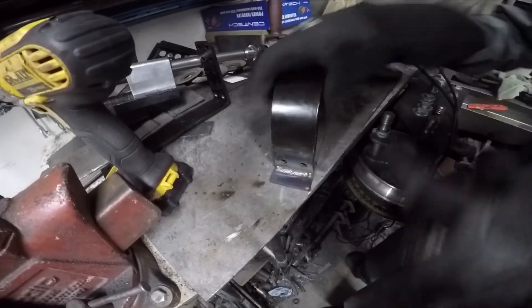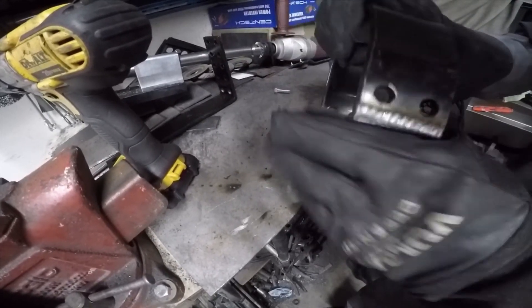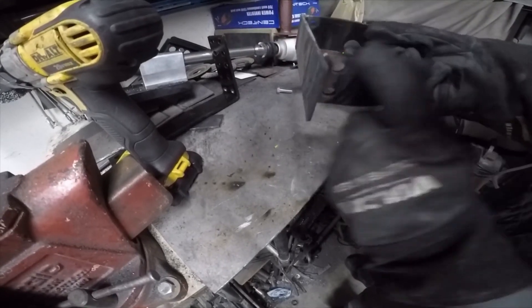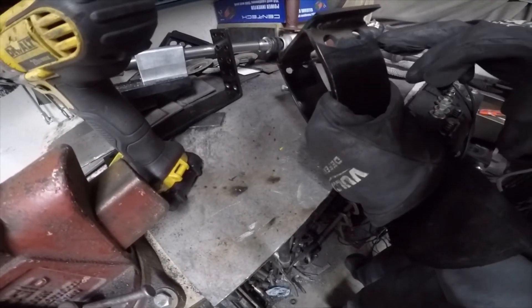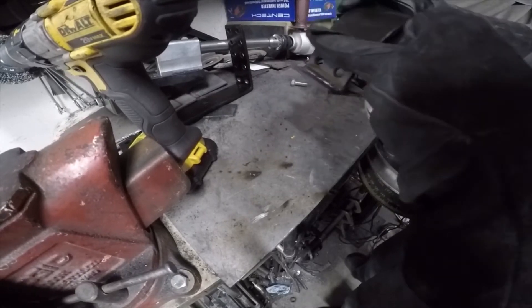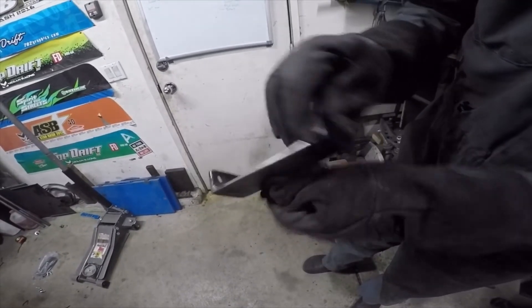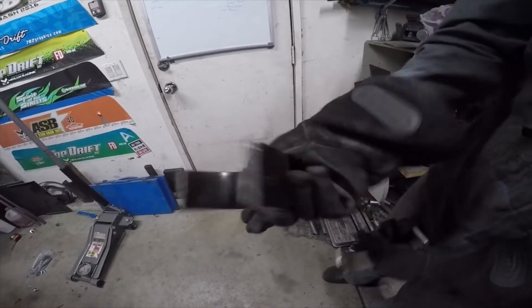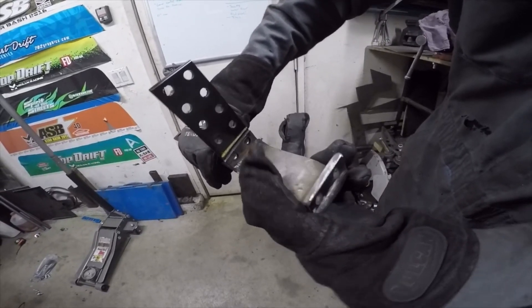This side is now welded all the way through — welded on this side in here and this side out here, all welded. You now have this weird D-shaped thing. We're going to cut off the outer edge so it's nice and smooth, cut off the eyelets, and flip it upside down — so this bottom piece becomes the lower part of the brace, no longer the big hoop. Now we have the edge we need on one side, the flat bottom base we needed, and the other piece is no longer needed. It will bolt flat to both sides and go straight across the middle.